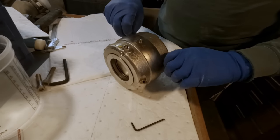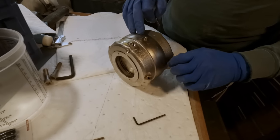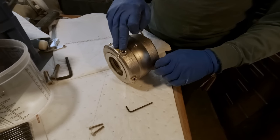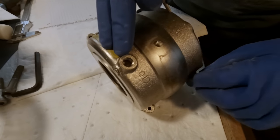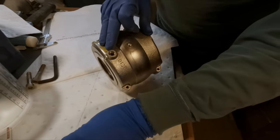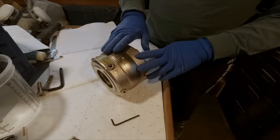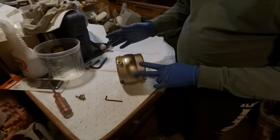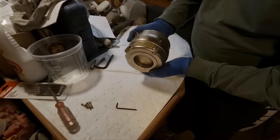It turns out these were zinc plated too, which is nice — will help with corrosion. The port on top is for a greaser; we're going to have grease lines running to this because we won't be opening the shaft alley except to inspect periodically. These do not need a lot of maintenance — it's two or three pumps of grease every 400 hours, so they're very good as far as low maintenance goes.